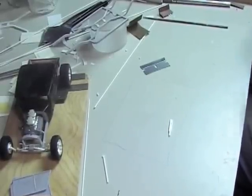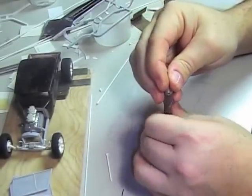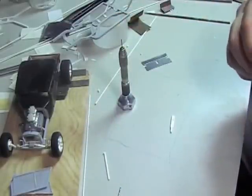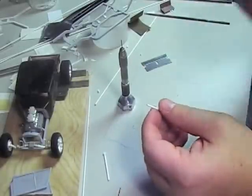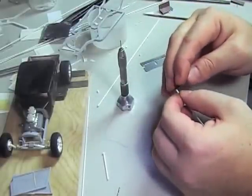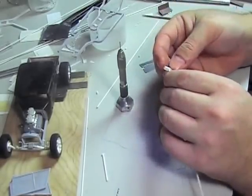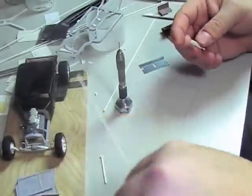Now you got that done, take your pilot drill bit and put it back in. Take your rod. Now, very important before I go to the next step, make sure your end is flat. If your end is not flat, it will throw your center off. And this is not perfectly flat, so now it's flat. Stick it in your hole. I don't think I got the right rod here. Lovely. Maybe this is the right rod.